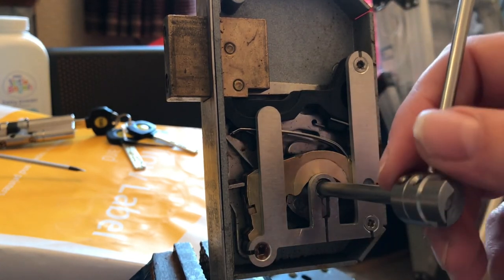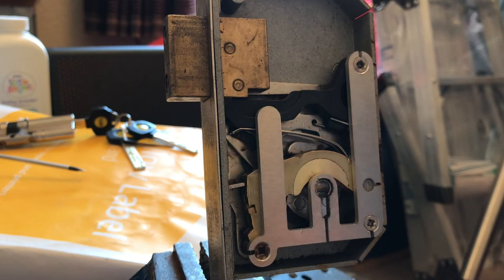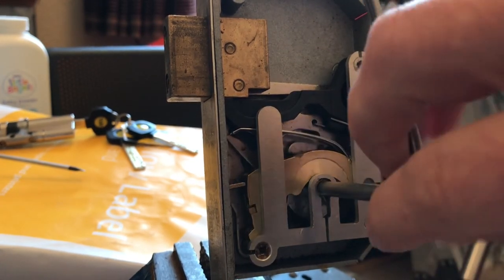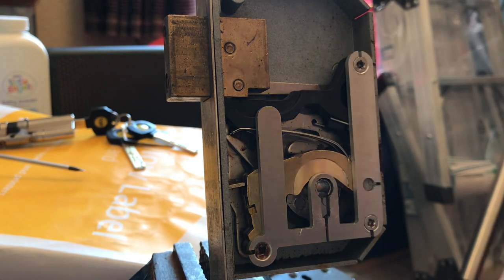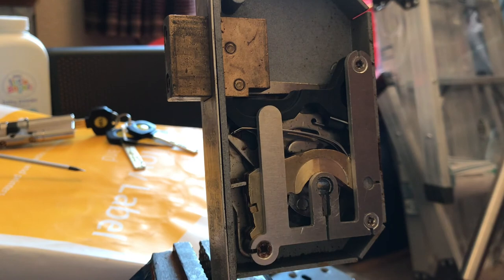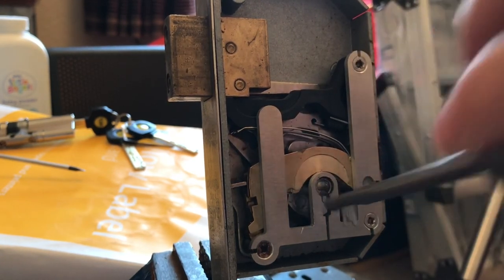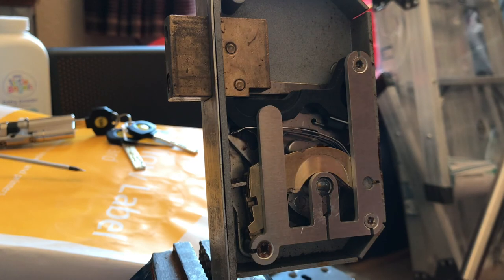Absolutely beautiful tool. This is the pin set I ended up with. I think one was the only one not in the correct position. Let's move one up - I think it might be higher than that. Move one up to a four. Let's have a look - one off. Last but not least, let's change one to a three. There we go! So that was actually the correct bitting. Reading from five to one, it is 4-8-6-5-3.